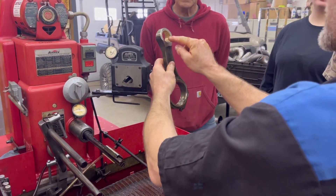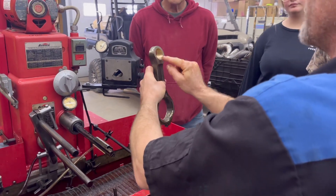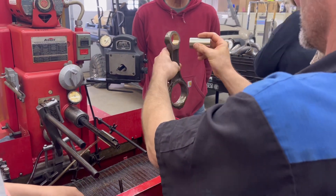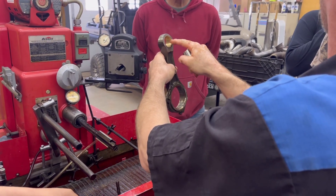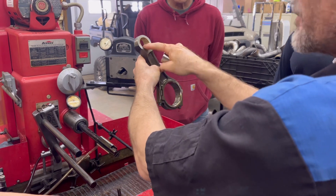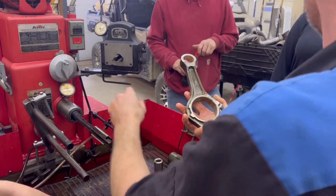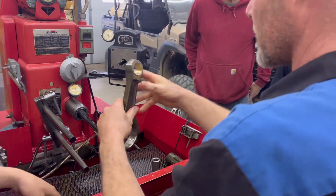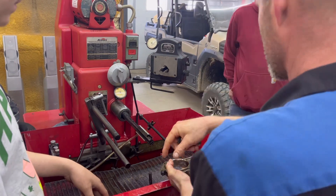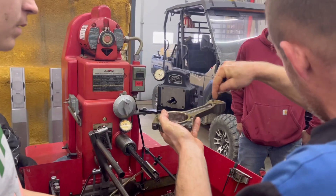If something happens here — this is a boring bushing; I replaced this brass part on the inside. If something was wrong or machined off, we can actually move where this pin is up or down and adjust those thousandths of an inch, just cutting where the circle goes — like moving the circle four thousandths up and cutting it. Technology will let us do that. So we put a big enough bushing in here. That's why it's called a boring bushing: you can move where this hole goes on the end.